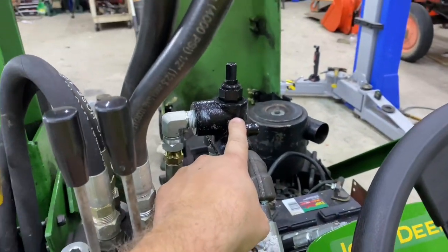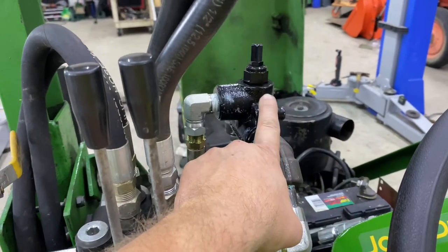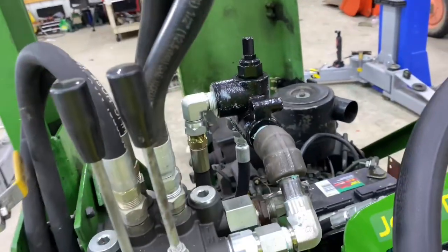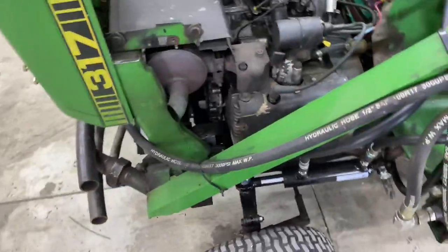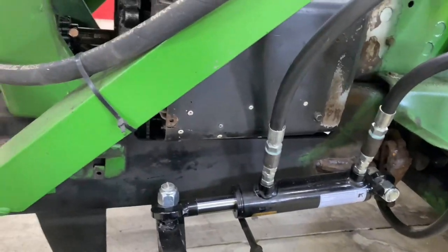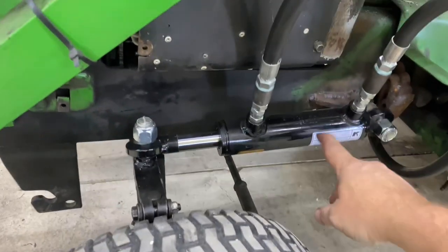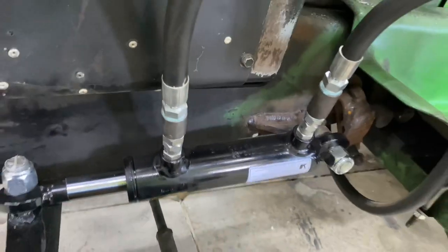So I added this one. This is Prince Hydraulics — I think it's a well-known brand. I bought this one off of eBay. Because when you steer it all the way, it dead-ends the cylinder out, which really puts too much pressure on the system. This is the new cylinder I just added. Here's the old steering — that's all gone now.